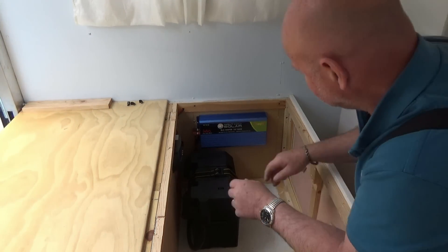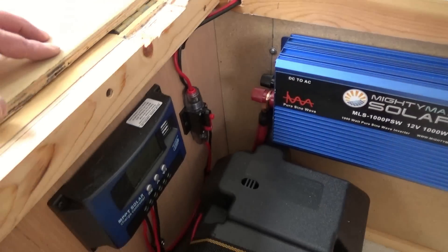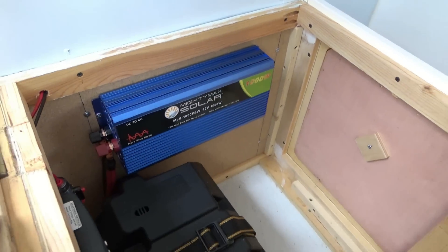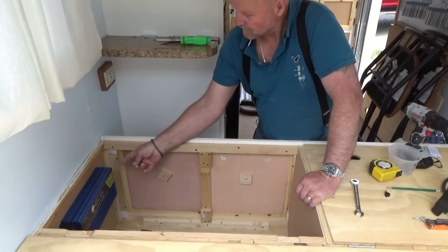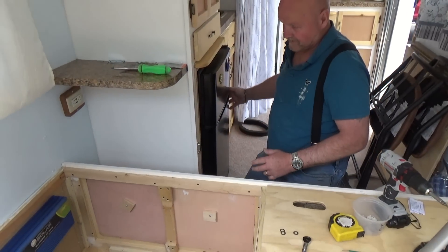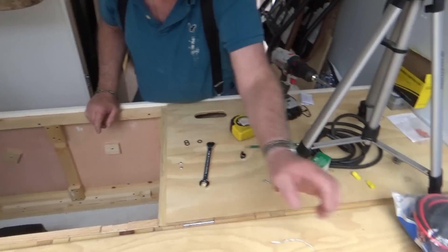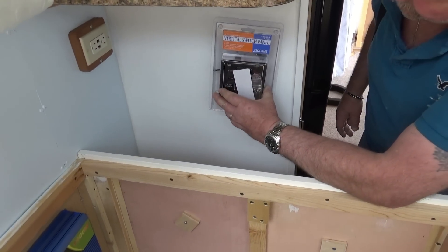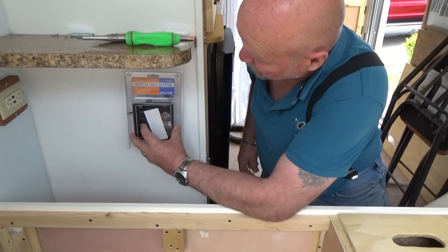Power to there. So that's Jack's setup — it comes in pretty good, nice little layout, clean, and power to the inverter, and it works. Now what's your next step, Jack? The next step is to run the cord, or the wire, into here for the refrigerator. And then run a set of wires into here to run the control panel. This is a 12-volt box so you'll be able to run lights or anything 12-volt from that. Then when I add my vent next, the vent will wire into this.